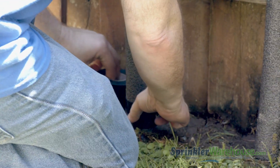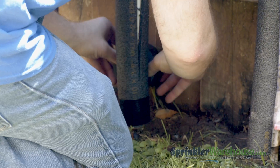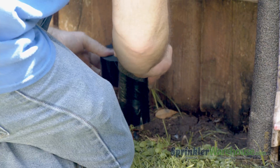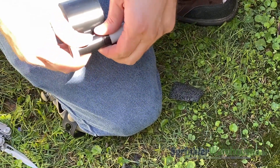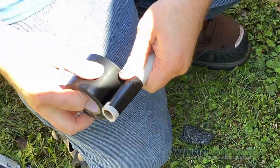We get asked by a lot of customers: how do you wrap the tape around the pipe when your backflow is really close to a wall or a fence and you can't get the tape roll between your pipe and the fence? Here's how: use a small cylindrical object such as a piece of PVC or even a pen or pencil, load some tape on the object, and now you've got a skinny tape roll that will fit where you need it.